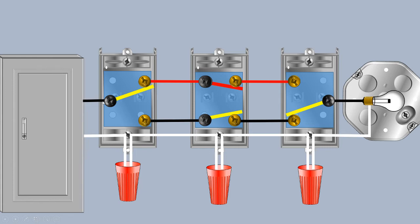Let's run through what happened when we moved those switches into their alternate positions. Like our three-way switches previously, we'll take a look at those first. We'll flip this paddle and we see that now we have this established path for current. If you're following the arrow all the way through to our load, from our load back through our splices on our identified conductors, and then back to our panel, which would complete our circuit, which means that our light would be on.